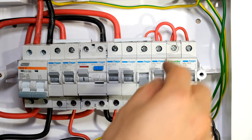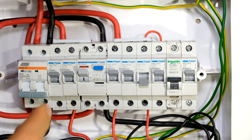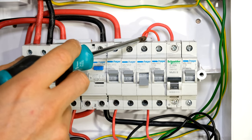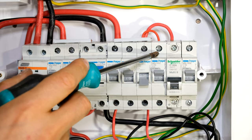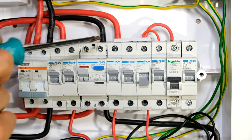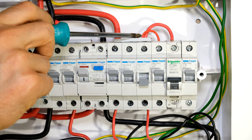Now if I'm in an emergency and I don't have a bus bar, a better solution would be to wire it like this. What I've done now is put them in parallel from this bus bar over here, so each conductor carries only the load for its own circuit breaker. This reduces the hazard, but keep in mind there is a limit to how many conductors are allowed in one terminal.